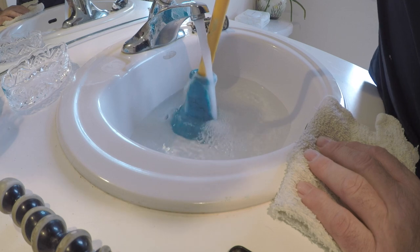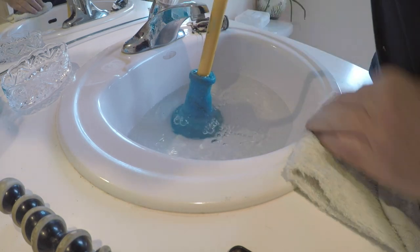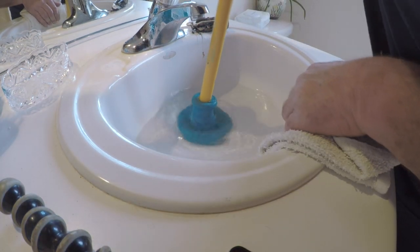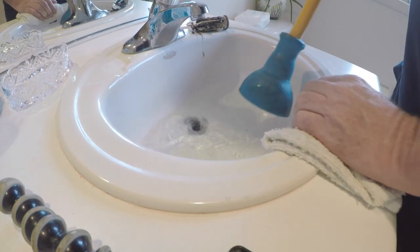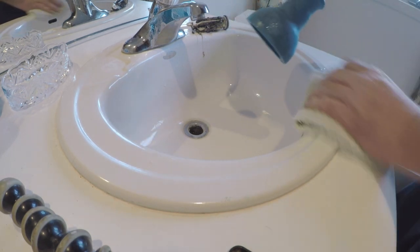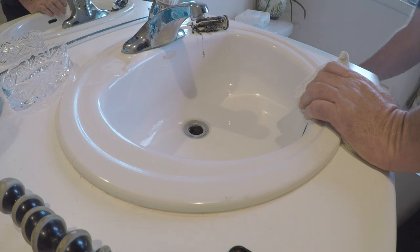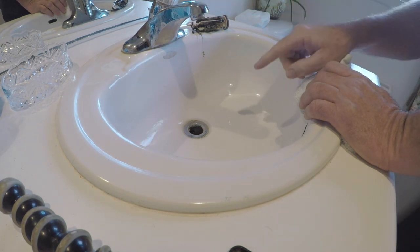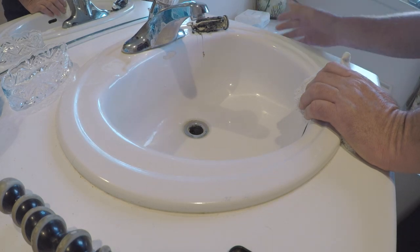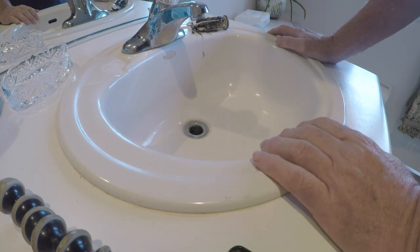All you pros know that, right? So, let me shut this water off. Let that go like that. You're draining down. All of a sudden, you go boom, boom. And we all us plumbers do know that this is a really short line that either goes right into the wall or into the vent that goes upstairs and ties into the toilet line right here, 3 inch. So it's relatively short run, 3 to 5 feet. So you can get it every time.